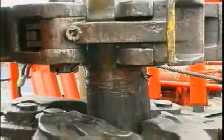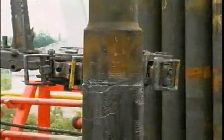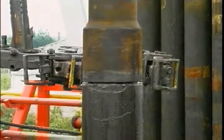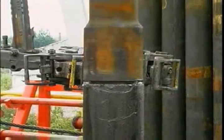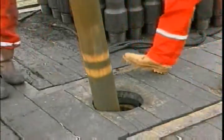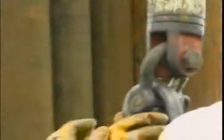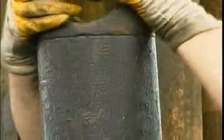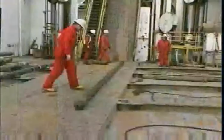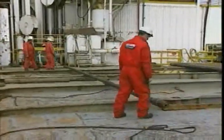Once again, use two tongs for breaking out. Place them properly on the tool joints — never on the hard facing and never overlapping the opposing joint. Slowly rotate the pipe out, keeping the proper hook snubber or top drive counterbalance tension. To lay down the pipe, set the joint gently into the mouse hole. Fix the hoist cable securely and lift the joint out. Put a thread protector on the pin end before you lower it down the V-door. As you roll the pipe to the rack, check it for straightness — if it's bent, separate it from the other pipes for repair.